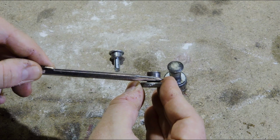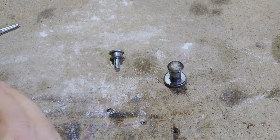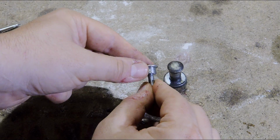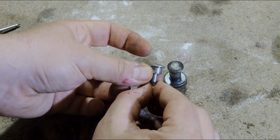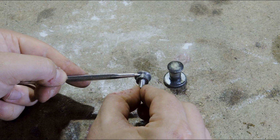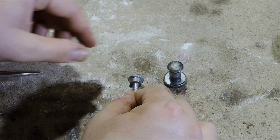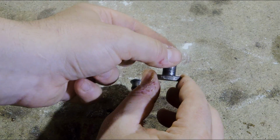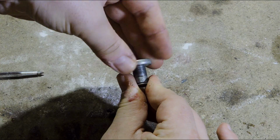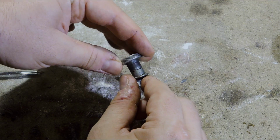This diameter out here is basically what fits perfectly into the lower handle half hole. And the other side is this machine screw with a piece of pipe on here. And this diameter fits perfectly into the hole on the upper handle half. And when they are screwed together, they look something like this. And so they ensure the least amount of rattle between the two handle halves.